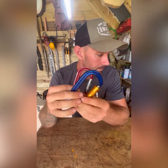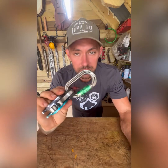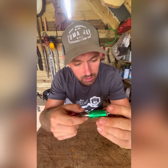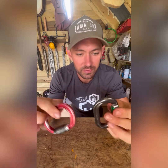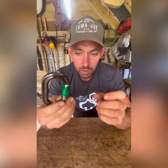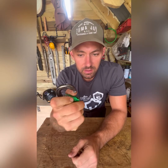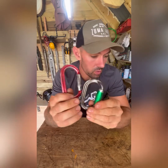If I'm going to buy a carabiner I'll buy them pretty much in this oval shape - I think they're just good all-rounders. On my climbing systems I have these Perfect O's, which are the small versions. They're a little bit smaller than the normal carabiner but the rating is pretty similar - 24 to 25 kilonewtons, so still just as strong. The only thing I didn't like is that when you put one on the end of your sideline or flip line, because they're so small it's quite hard to undo with one hand.